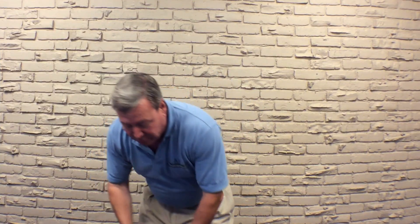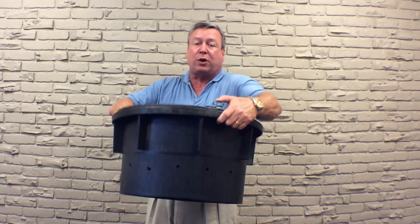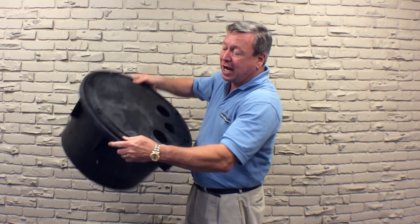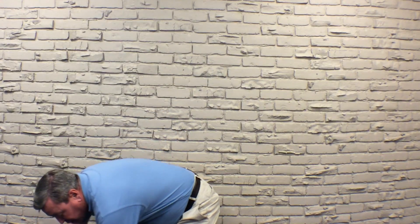That sits in the sump pit. We have one here that's cut in half to make a good demo. The sump pit is 24 inches round and goes 30 inches below the floor. The cover that we use bolts right down into the top of it. The thing is pre-cast and has holes drilled all through it to allow the water to enter in.